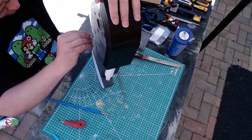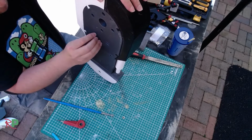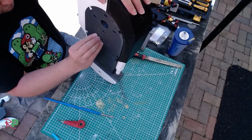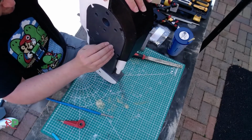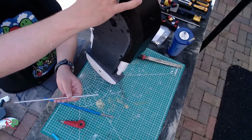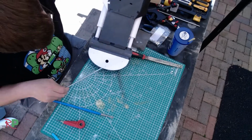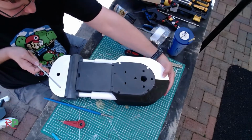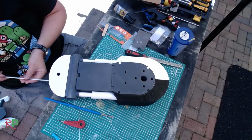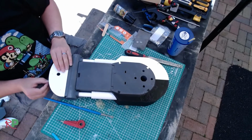But so put the M3 square nuts back in. And they just slot into there. If you don't drop them. So they go in there. And then very carefully tip it. And grab your M6 threaded rod, 300mm times 2. And see there's 2 holes at the bottom of the leg. And they should just slide up there and then make contact with the M6 square nut.